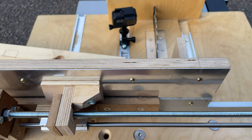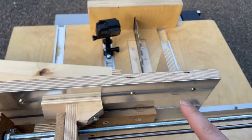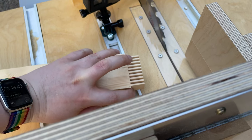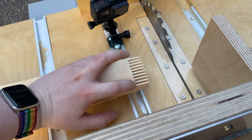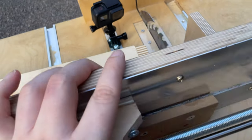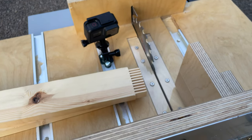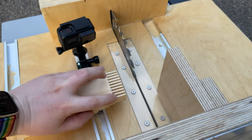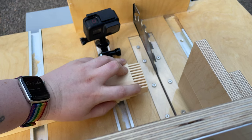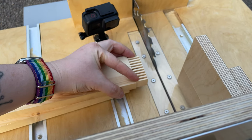So for instance, if we wanted to make fingers of three millimeters thick, we would do a cut, move this forward and backwards, press a button on the machine — that would then move it along three millimeters to the start of the finger itself, as we've now created one of the gaps, and then it will move it along the full width of that finger to get to the starting position of the next gap. If it was a finger of six millimeters, you would do a cut, push a button, it moves the whole carriage across three millimeters, you do another cut — now you have a gap of six millimeters — push the button and it moves along to the starting position of the next finger, leaving a six millimeter uncut area which is the finger. Then you repeat: gap of six millimeters, finger of six millimeters, and another gap of six millimeters — rinse and repeat.